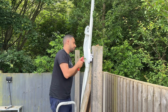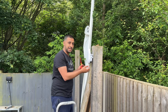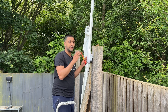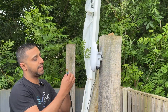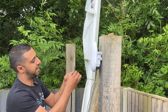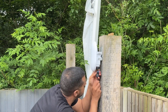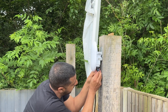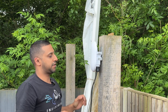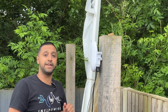You need to put in all four screws, so we'll go ahead and tighten this up. There you go — that's now not going anywhere. Next we're going to waterproof the ethernet connection and then slide the cover up so it isn't going to get damaged in any weather conditions. I have my ethernet cable here — I'm putting on the rubber gland around it, then the piece that connects up onto here, and then we pop this on too. That's connected in, we push this up and tighten it on. You can feel the seal — there's not going to be any water going in there — and I can see the light flashing on here now, which is perfect.